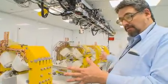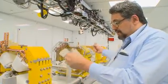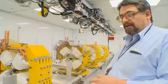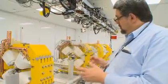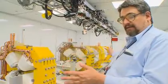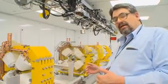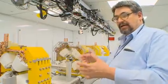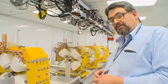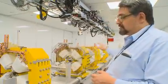And the goal is, once we've aligned the magnets, we have to be able to put them back onto a common position in the same alignment. That is, once we align the magnets inside this environmental room, we have to reproduce that alignment in the NSLS-2 tunnel. And that is what the last three and a half to four years worth of development has come up to. Right now, the magnetic centers of these magnets are aligned to within a few microns.